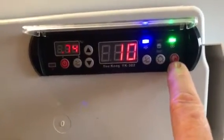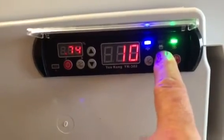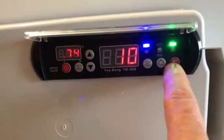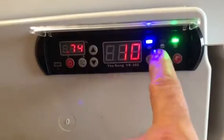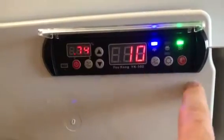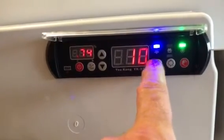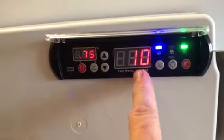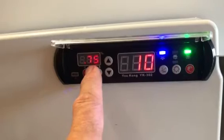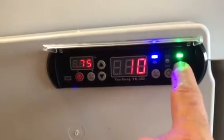There's no light connected so it's switched off. This is your defrost button, and this light in the middle would come on - I'll elaborate on the defrost function because this controller will defrost your setup. There's your compressor or fridge indicator light. At the moment the fridge is running at 10 degrees, humidity is 75%, and I've got a fan control - the green light is on, I've got two fans in here.